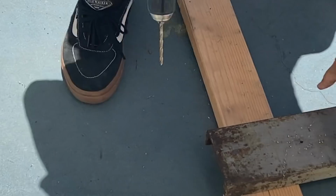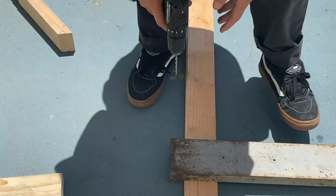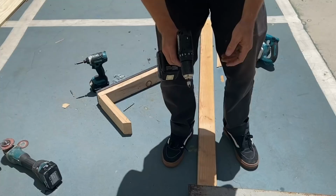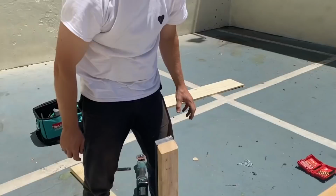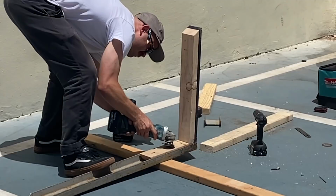Yeah, when you're drilling, you want this. That's the sign of a sharp bit. Yeah, if you're getting one solid piece of metal, oh yeah, you're stoked. We're gonna countersink these so those screw heads sit flush. Zip these off just when we're handling it. Yeah, reaching underneath. That to there. It's getting cut right there.